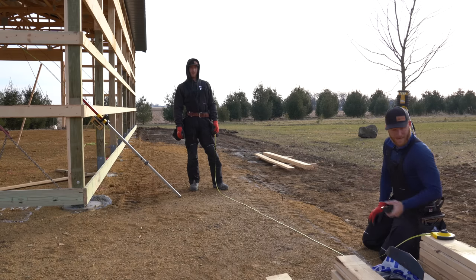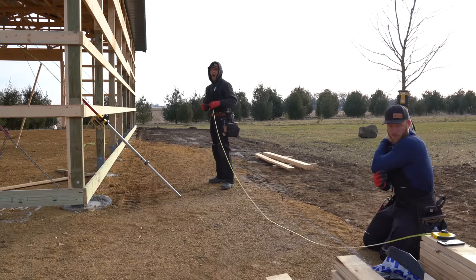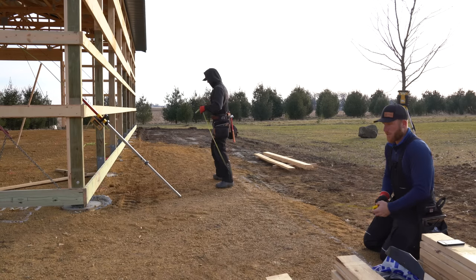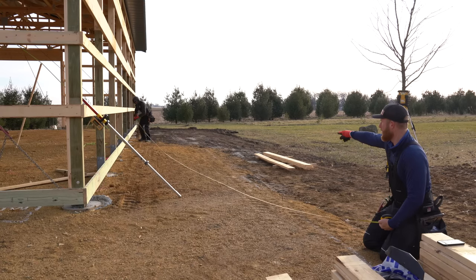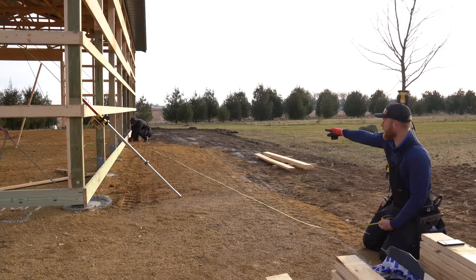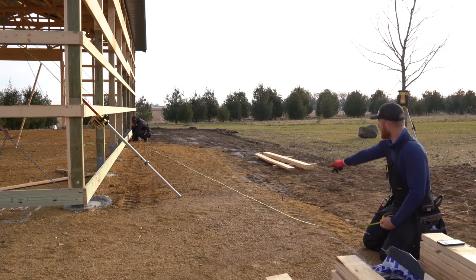We're 40 foot 9 1/2. So you gonna burn me a foot then? Yep. Okay, so 41 foot 9 1/2. Let's see where we're at. I've already laid out a pin on that end down there, pulling a diagonal off of this corner and from where Greg was back. I pulled that dimension and then I did the opposite to get this pin.